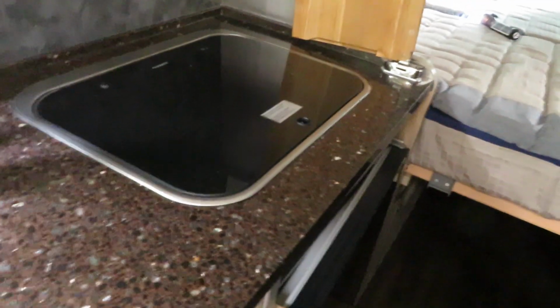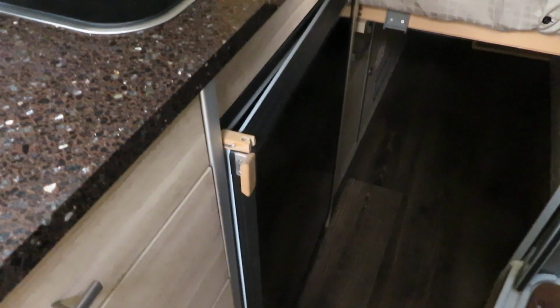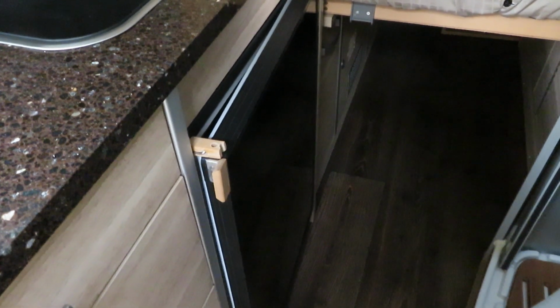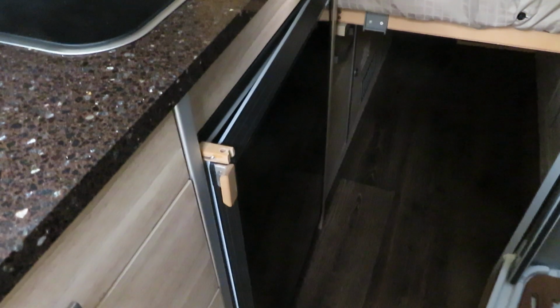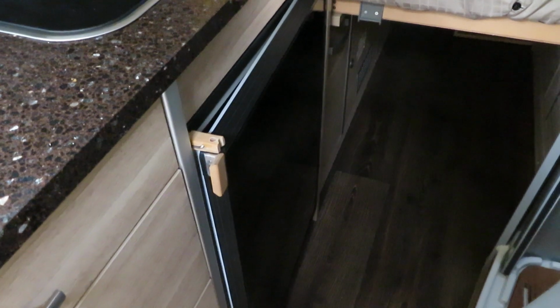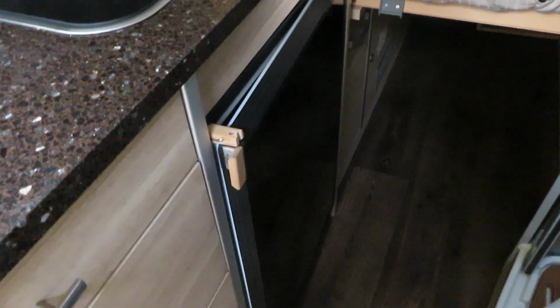And because I have no electricity right now, but when I travel, I like to use my refrigerator. So I also implemented what is called a solar fridge. The solar fridge is also connected to the charge side, but instead of connecting to the charge side bus, I connected to the solar charge controller load port. So the fridge is taking electricity from the kicker, but the kicker is being recharged by solar. So I could run this battery 24/7 without turning on the EcoTrack.